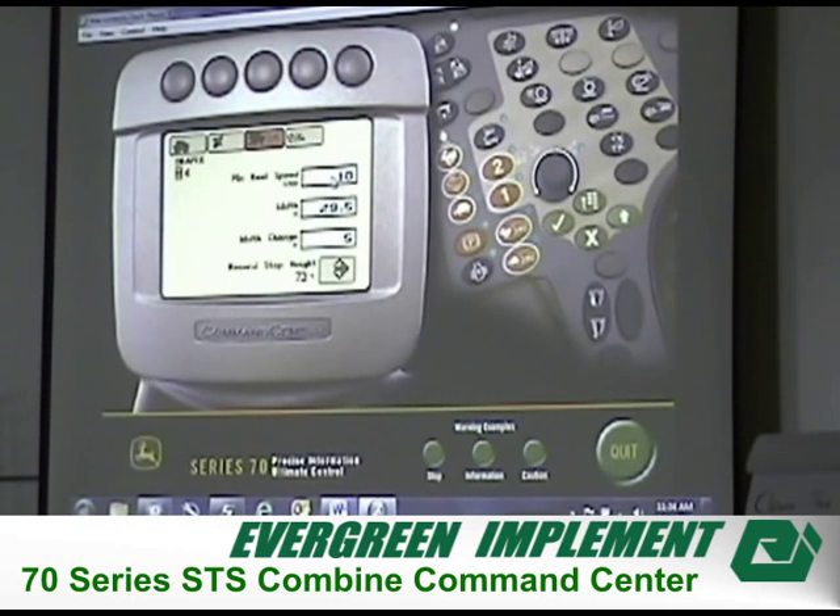Minimum reel speed is something people run into when running automatic reel speed. On early 50 series, there was a check spot where you'd set your minimum reel speed so it didn't always slow down too much. On these machines, we put our minimum reel speed in on page three or five for our combine. You can change it so that when you come down you want to keep that reel going, or you never want it to slow down until a certain point. Somebody may have turned it up on you and now it won't slow down — so here's the spot to go fix that.